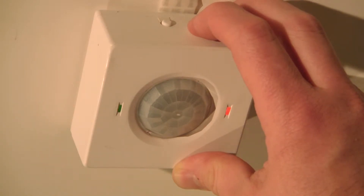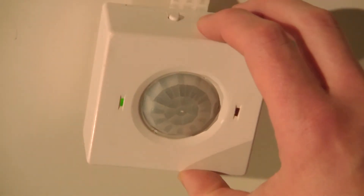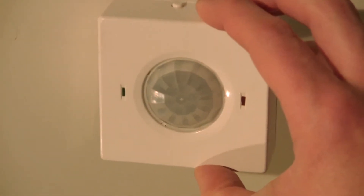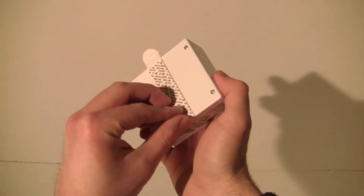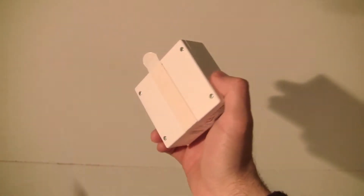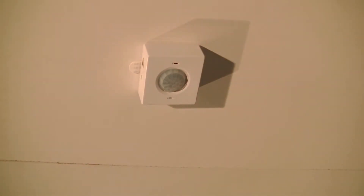This indicates the unit is calibrating to the light source. Once complete, the green LED will flash if it is locked onto an electronic ballasted fluorescent light source. The orange LED will flash for a magnetic ballasted fluorescent or an incandescent light source. Once you have verified the DataLogger has calibrated to a light source, pull the protective layer off of the adhesive strip and press the DataLogger firmly to a surface. Repeat this process for all remaining devices.